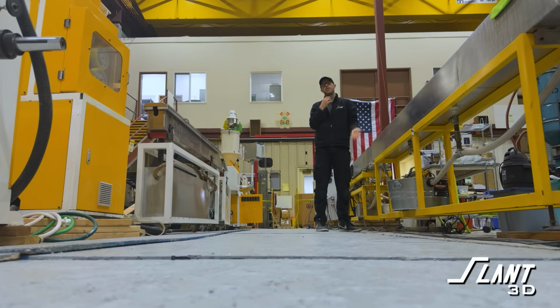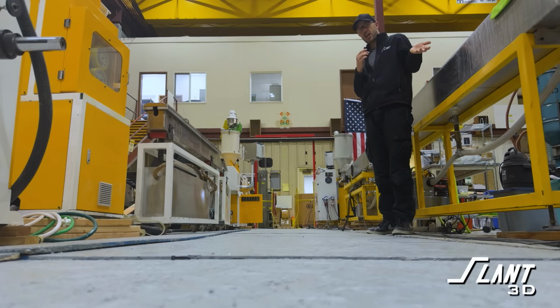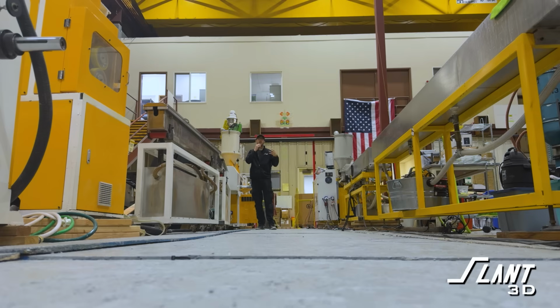Extrusion itself is very, very efficient and highly automatable and really stable once it's operating. So there's no reason to really have people standing by all the time. But that spooling is kind of the challenge. While there is machinery out there now that is able to spool onto 1 kg spools continuously, it's a little bit finicky and it's very expensive. And that's really true if you're trying to reduce the cost of filament. You don't really want a lot of expensive machinery because then the time of amortization is all still there.